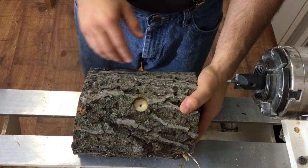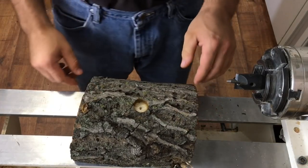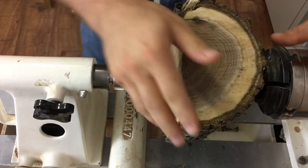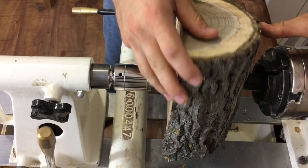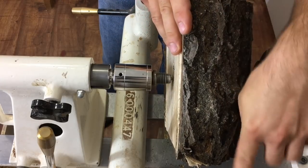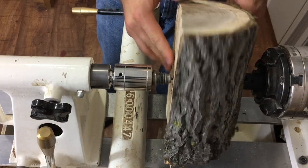Please remember this is not an instructional video and is meant for entertainment purposes only — your safety is your responsibility. So here's our piece of butternut. I've already gone ahead and drilled a one-inch hole with the spade bit so that we can mount it between centers using our one-inch spur drive. I'm just making sure as I mount it that I get the top parts of the wings nice and even, and I'll sight down to make sure the side pieces line up fairly well too.